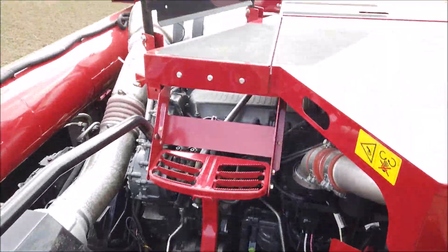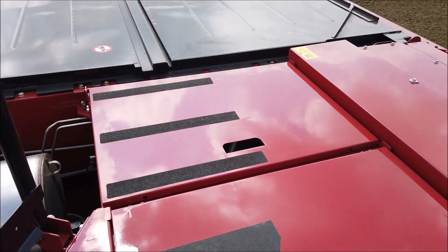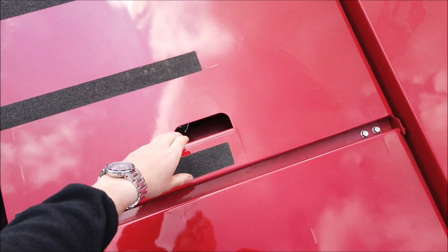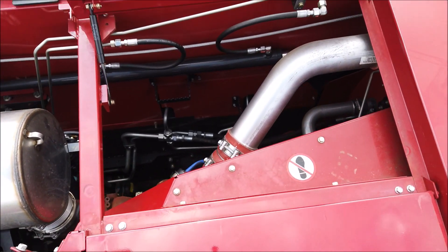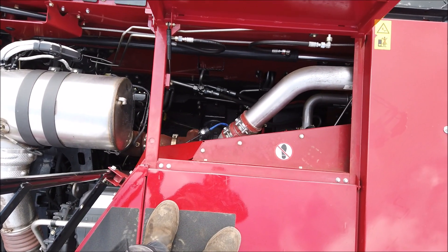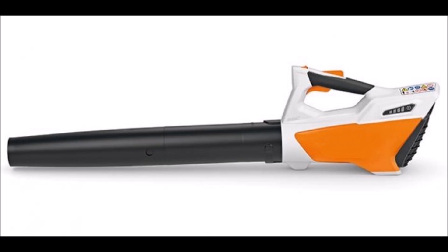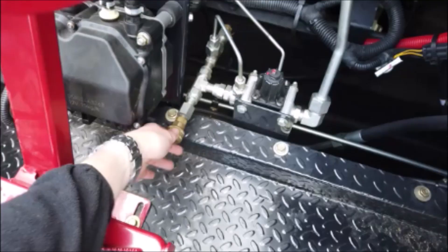Full access to the front side of the engine and around the 3-speed rotor gearbox can be achieved via the hatch at the front of the engine cover. Make sure that any straw, dust and other debris is blown away and clear of any build-up. Case IH recommend a high volume of air at relatively low pressure, such as you would find from a roadside compressor. A commercial leaf blower can also be used to great effect, as well as the in-built compressor with connection points located at strategic points around the combine.